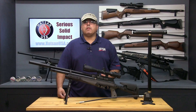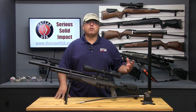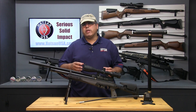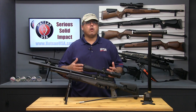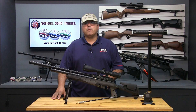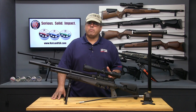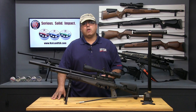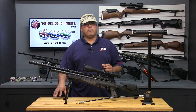Many people have asked about possibly using a bicycle pump or some sort of standard shop compressor. It's important to note that those options really only pump up to about 120 or maybe 150 psi. We need 200 bar, which is around 2900 psi for our AT44 to work properly, so you need a very special hand pump for the job.